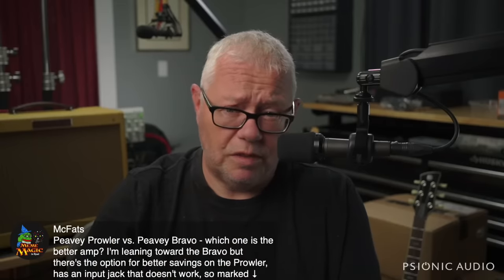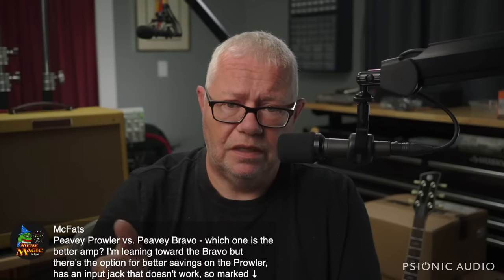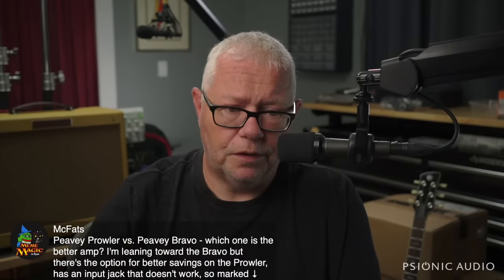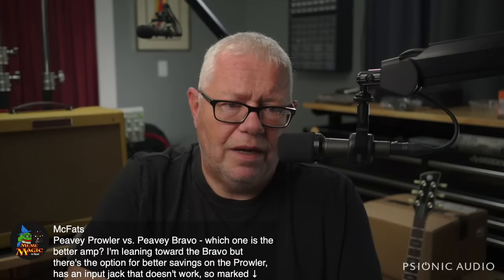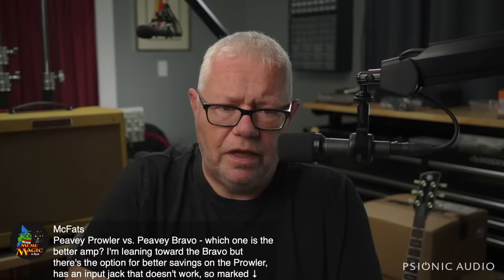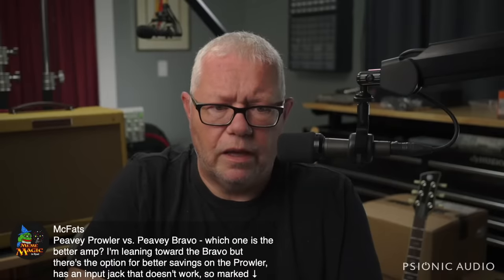that's what supports the PCB. So if you replace three pots and replace a jack, then you've got two pots holding the whole thing on. That's not good either. So I wouldn't buy either unless you could open them up, and unless you know what you're looking at, you're taking a risk. I'm sorry.